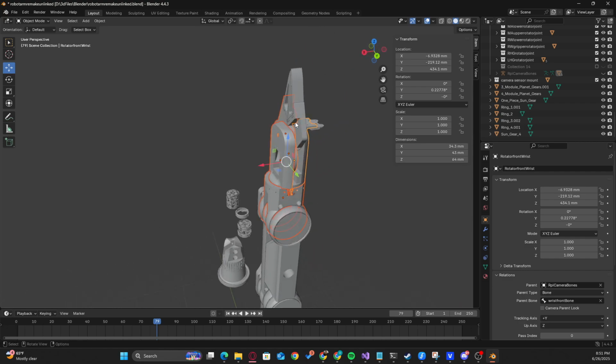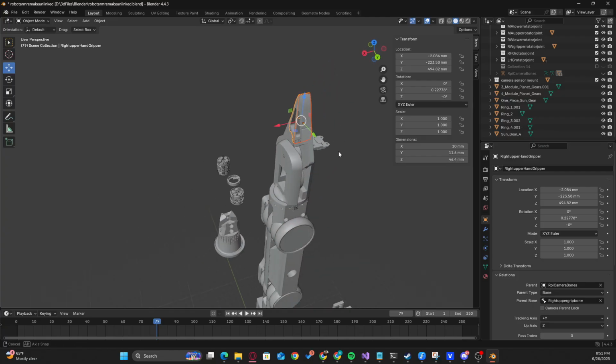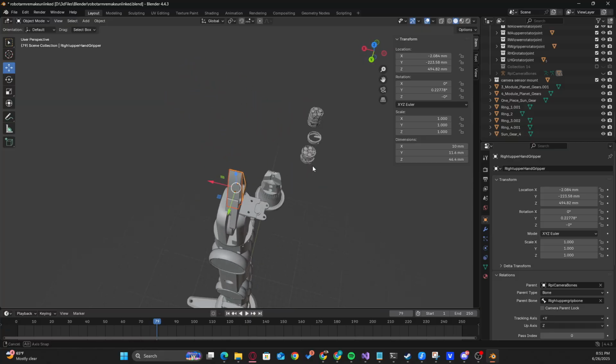The gears are in there. The grippers slide on good. These are separate from these because of the material they use. You can use any hard material for these, of course, but for this one you have to use TPU, just so the grippers can grasp the item.